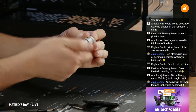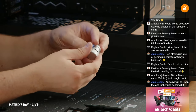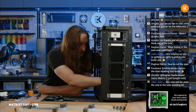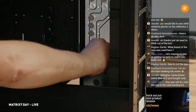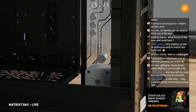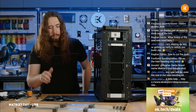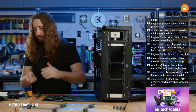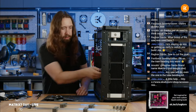So when you tighten it by the collar it will grip, and when you come to undo it, it won't ever undo itself. You won't ever get coolant trapped in the middle, and it's just the perfect guy for the job. Much better than the ball valve if you just want it to drain. Of course, if you want to have this in line with a CPU block or something, then the ball valve is the right choice, because that's actually full cross-section open to the coolant. And these just have like two sets of holes and the coolant wiggles around. So they're a bit restrictive if you wanted to use them in line, but fine like this.